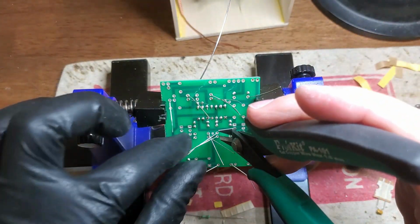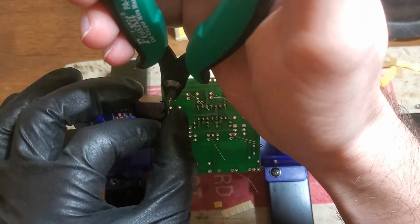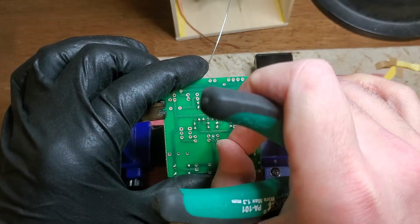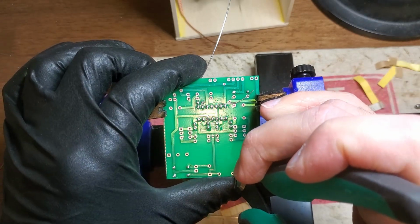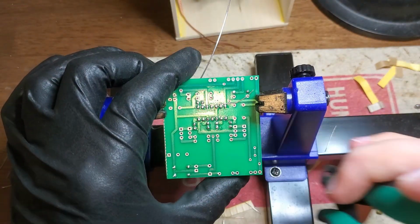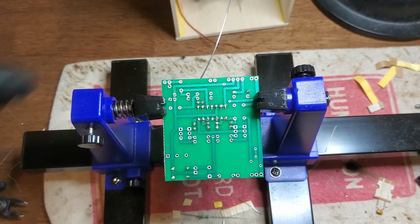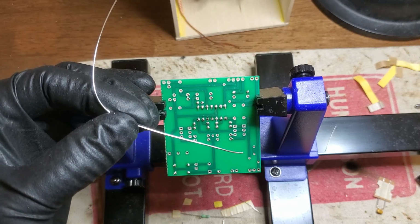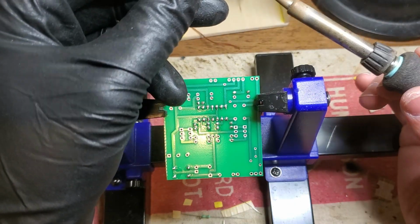I'd like to pretend that I'm a neat and organized individual. It's been drilled into my head that solder is not glue. So I try to at least maintain some sort of mechanical sureness in my joints, such that, yeah, I can just rotate this board around and nothing falls out, because at least everything is crimped and sitting on the board while I wait for my iron to warm up. Just like the honey says, keep your tip clean.